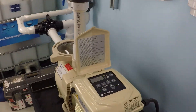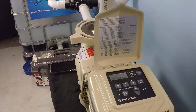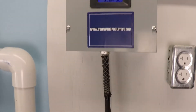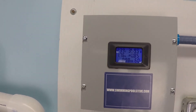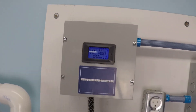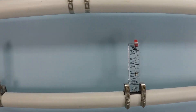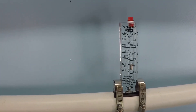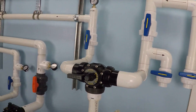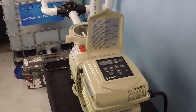We have a variable speed pump running here. As you can see, it's currently running at half RPM, or 1730 — half would be 1725, that's as close as we can get it on this particular model. Up here on my power supply I have a wattage meter installed so we can monitor the real-time power consumption. I also have a flow meter installed over here so we can monitor how much water is actually moving through the system. I'm going to use these devices to show you how a variable speed pump is going to save you on your electricity costs.